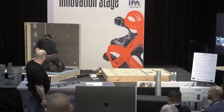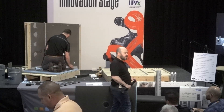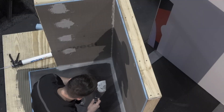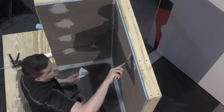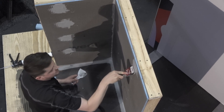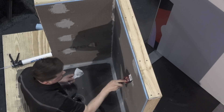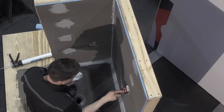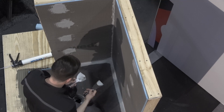Greg is covering the screws and washers with sealant — that also is part of the specifications for the Wedi shower system. The topical application of sealant is spread flat to one inch past the seam in both directions, and you also cover the washers and ensure the sealant is one inch outside the perimeter of the washer as well.